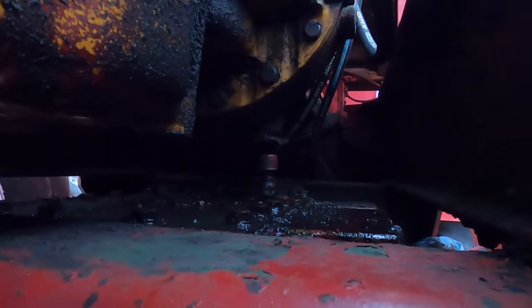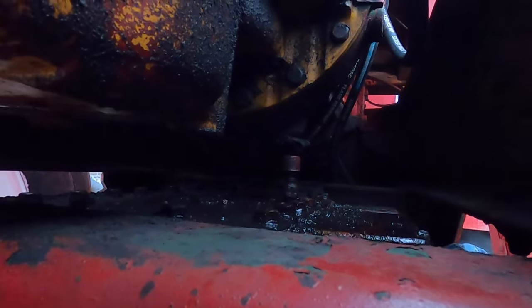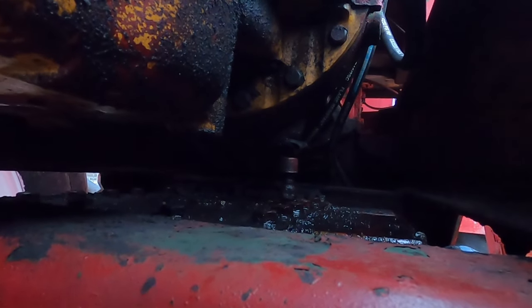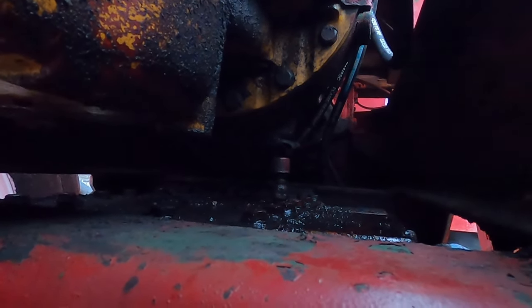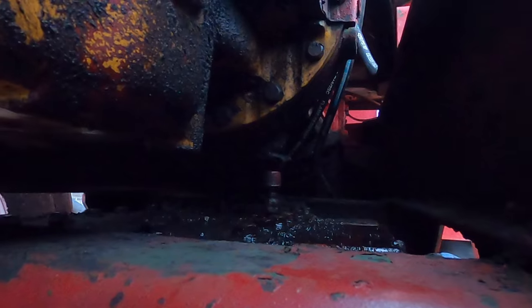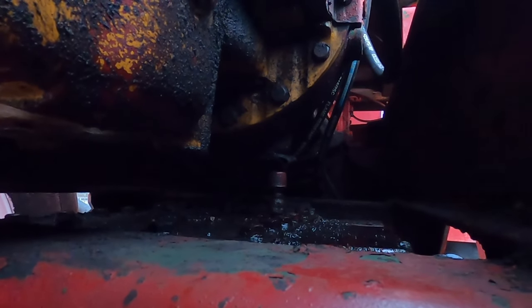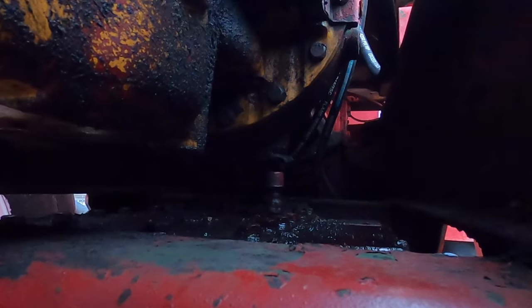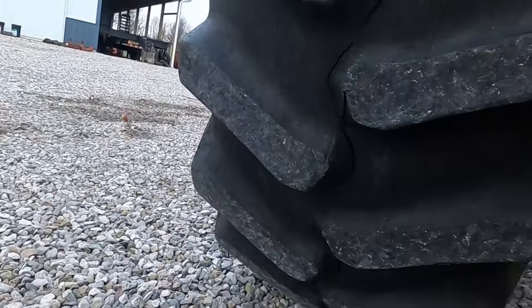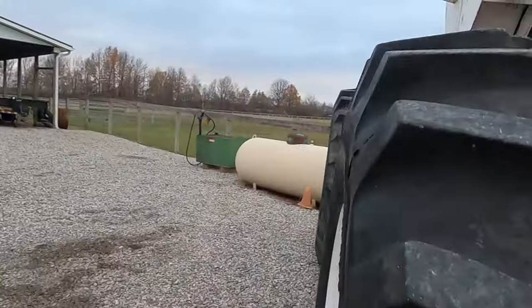I think what I'm going to do is measure where that plate is leaking. I tighten down the ends and they're good, but it's leaking out of the middle — it's almost like I need to put some wood across there and wedge it up in the middle to help seal it. I need to keep the fluid in there longer to let it wash better. The main thing is it was still slipping in fourth and fifth a little, but it's moving. Last week in reverse, backing it in here, it barely moved — so this is progress.